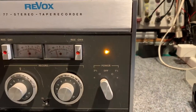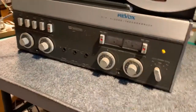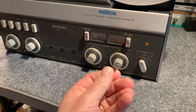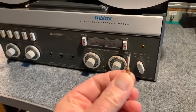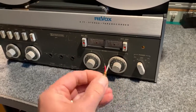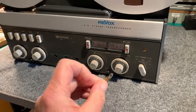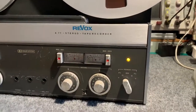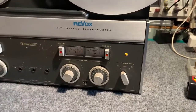I installed an LED in place of the dial light. The dial light that was in it was sort of working on and off — intermittent — and the actual bulb is intermittent. This isn't the original fit; somebody put in a wired-in type bulb and there's something intermittent inside it. I didn't have the correct bulb, so instead I replaced it with an LED, and that'll be the last time anybody ever needs to replace that. It draws about 8 milliamps whereas the bulb used to draw about 50 milliamps.